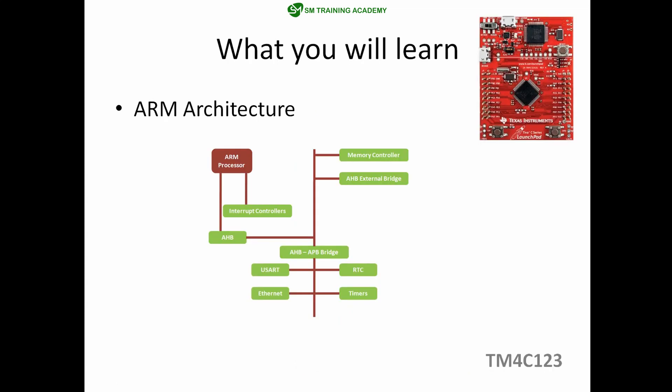For the start, we are going to learn what ARM processors are, the various types of ARM processors, and then we will learn about ARM architecture and memory maps. Since the microcontroller we are using — TM4C123 — is based on ARM Cortex-M architecture, you must have a solid understanding of it, including the internal register structure, before going into the actual programming part.